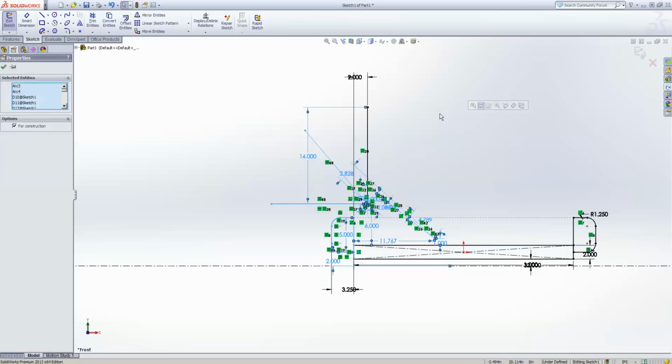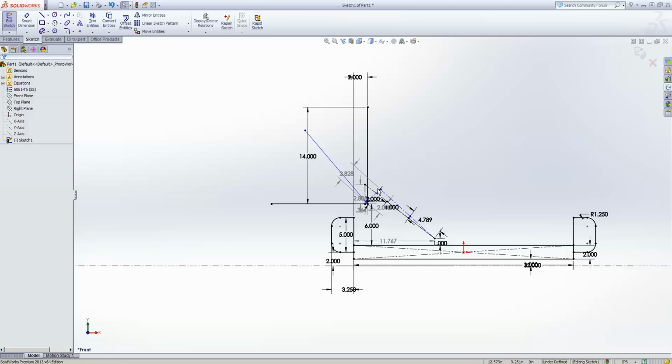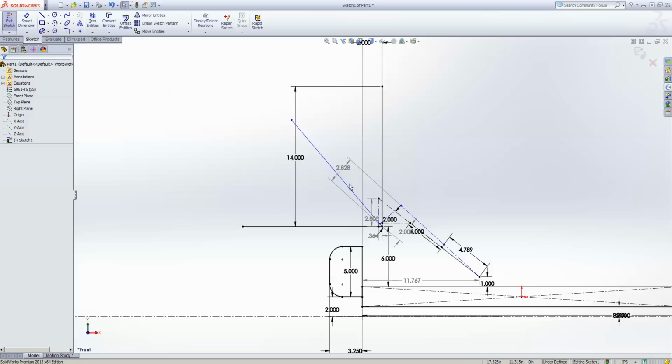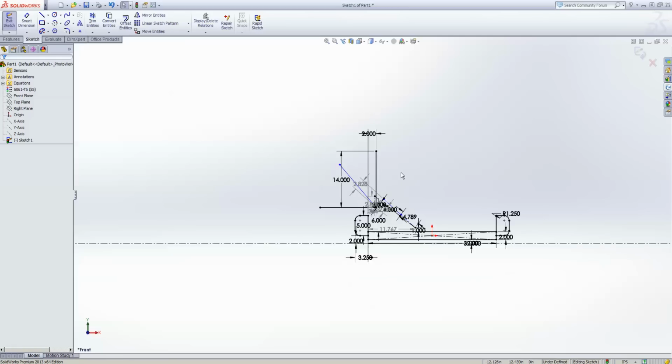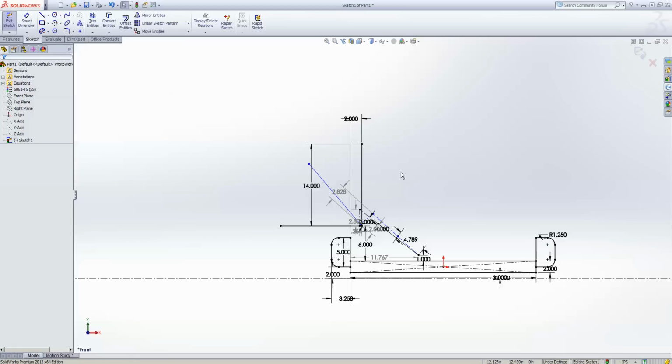Now, what I haven't quite decided on, because I've used just about every way that SOLIDWORKS has to link dimensions to other parts and assemblies, I've yet to get the holy grail of being able to draw a whole robot like this, linking pertinent dimensions to the whole robot. Unfortunately, SOLIDWORKS implementation of global variables is just not quite there yet, in my opinion, especially when you're working with inexperienced people. I've used sketch blocks, and that blows up a little bit. I've shared geometry at the assembly level. I've passed equations at the assembly level, and both of those are just kind of too slow and too tedious.